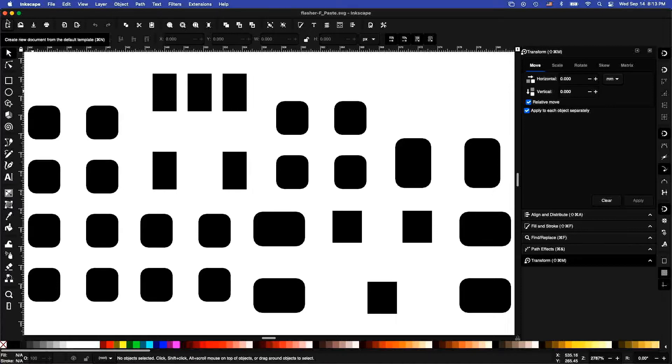You have to have a CO2 laser — a blue laser diode just doesn't cut the mylar very well, if at all. It turns out you can offset paths in Inkscape, but you can only do them one at a time, and it's not something you'd want to do on all the pads of a large board. So what I've done is I've written a Python script — there'll be a link to a GitHub repository where you can get the script. It basically uses the edge-cuts layer and the front-paste layer to produce two more SVG files: one for the frame and one for the stencil. It does all the path offsetting, changes fills to outlines, and gets everything ready to be loaded into K40 Whisperer and cut on the laser cutter.